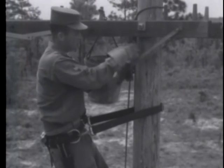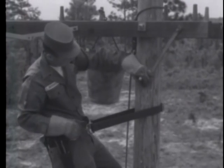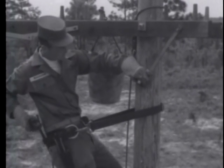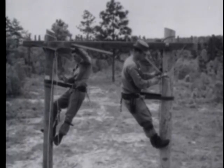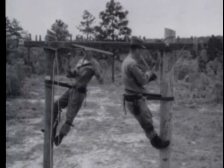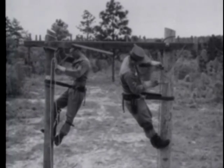Two lengths of crossarm braces are used, a 20-inch brace near the end of the crossarm and a standard 30-inch brace toward the center of the crossarm. H fixtures often have several crossarms. The additional crossarms are installed in the same way as the first one.